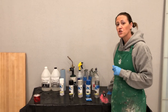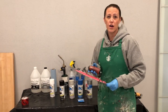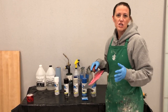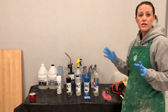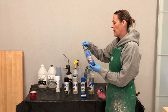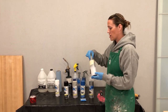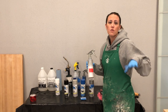We said we're going to be using unconventional tools for the striations. Instead of a paint stick, we'll be using a concrete trowel — we found that this works really well. The rounded edge works great, you have a handle, you can reach far, you can control it, and it just moves the epoxy and the paint in a very cool way. Depending on how we go, we may end up adding some metallic alcohol — ocean blue metallic, deep silver metallic, and pearl white in case we need it.